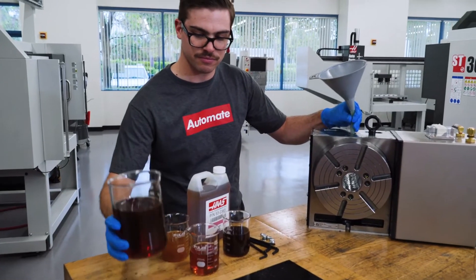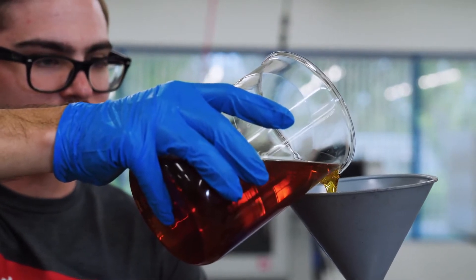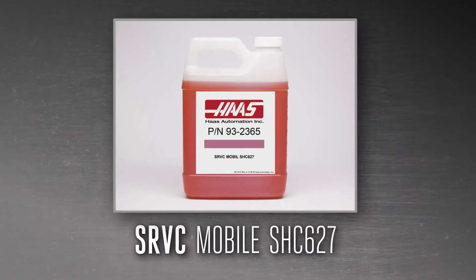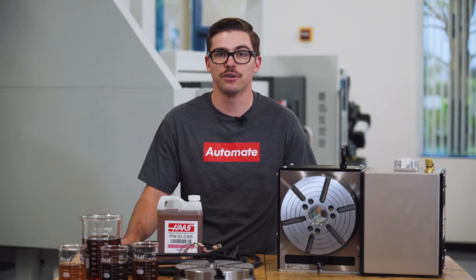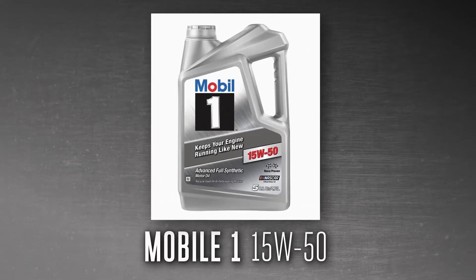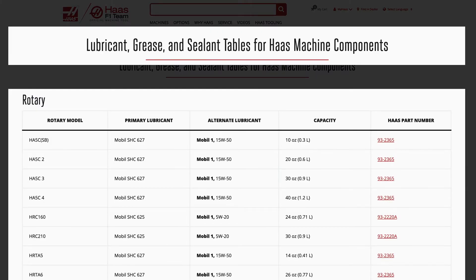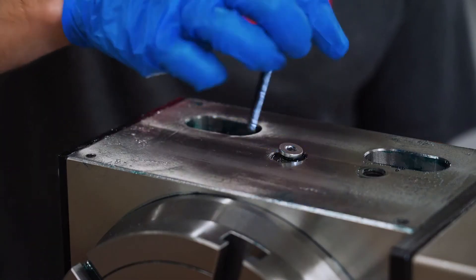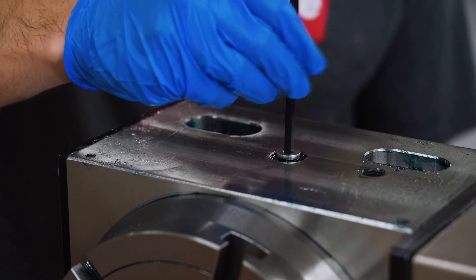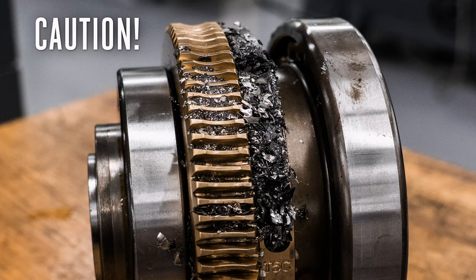Next, use a small funnel to refill the unit with oil. Reference the lubricant grease and sealant tables on the Haas website for the proper oil and quantity to use. In this case I'll be using 26 ounces or 0.77 liters of Mobil SHC-627. If you don't have this oil in your shop, you can use an alternative synthetic motor oil available at any automotive store — we recommend Mobil One 15W-50. Make sure to put in only the amount of oil specified by the lubricant grease and sealant table. It can be tempting to continually top off the oil or fill the reservoir all the way to the top; however, doing so will affect the performance of your rotary and even cause it to stop working.